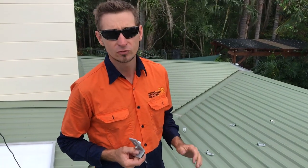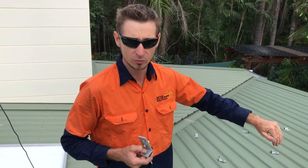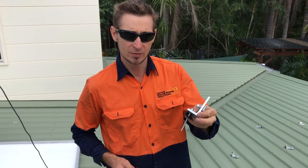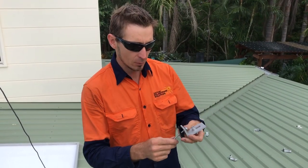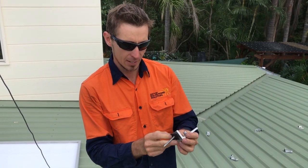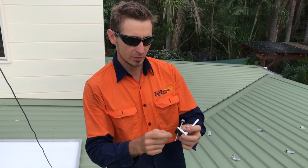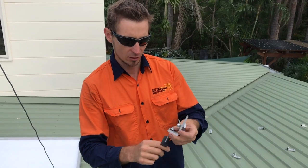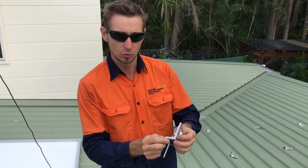All these different types of roofs have fixings through the sheets with screws, and for them we use a tin bracket like this — it's an L-foot. You can see the shape of the L there. We have a big screw going through the bottom with a rubber pad it sits on to make sure it's sealed. On top of the screw we've got a washer with a rubber foot as well, so it all bolts down and is sealed up — nice and watertight.